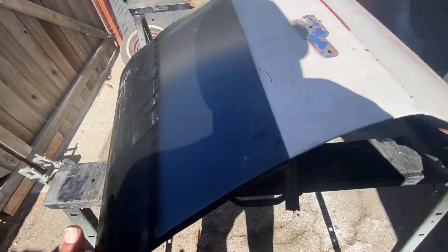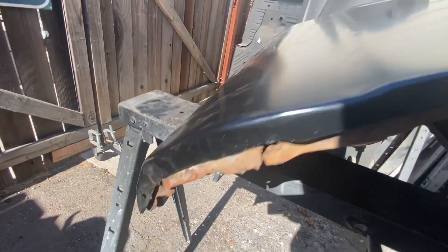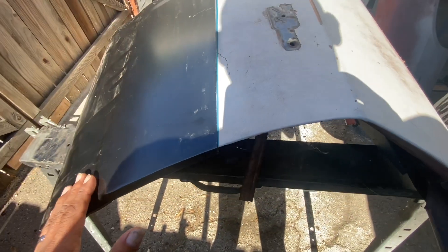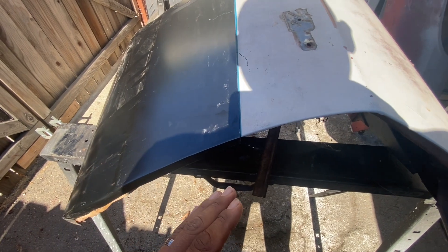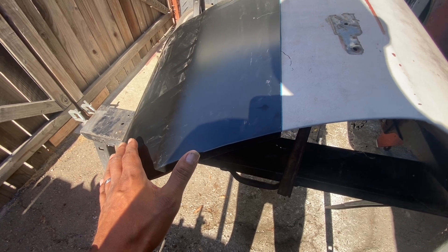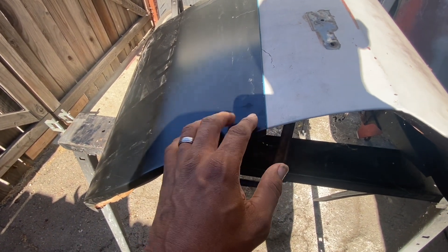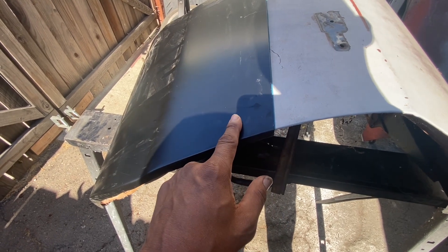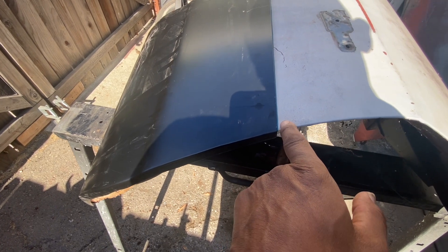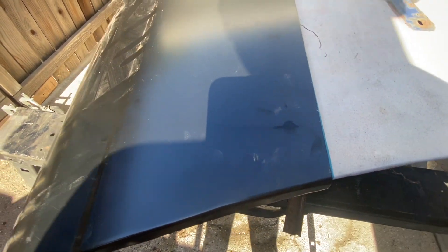What I do is I'm just going to lay it over like so — you can see it there. Then I'm going to draw a line here to mark it. Obviously, if I cut at that line, I'm going to end up having an issue with it being too far down because I need a gap in order to weld. So I'm going to cut above the line, and that blue line will kind of be my gap itself.